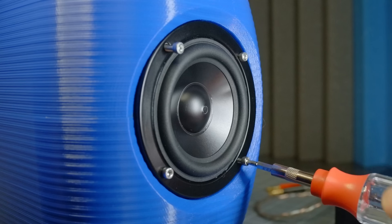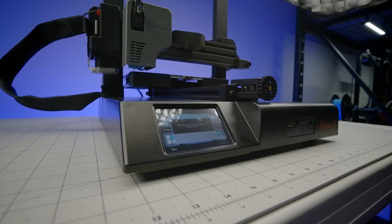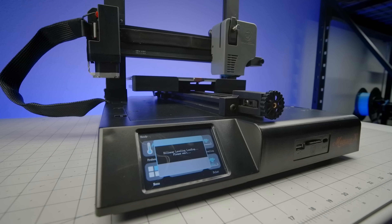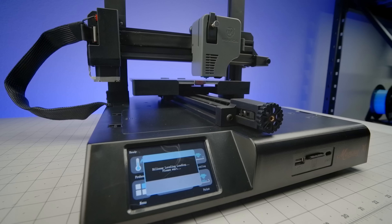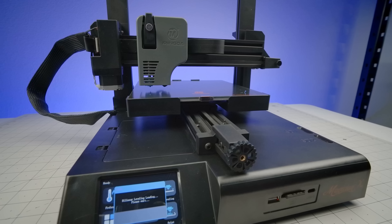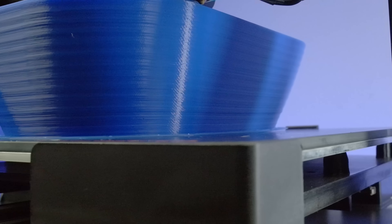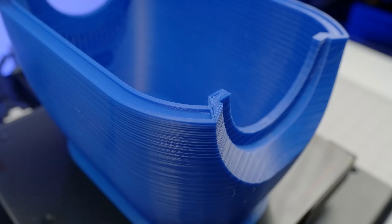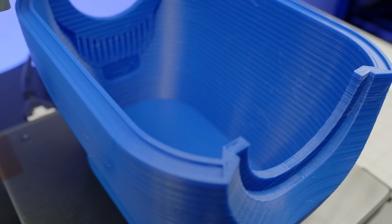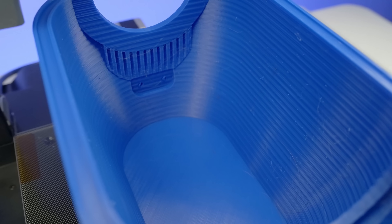It means that we're just about done. Though, before I cut to the sound demo, a few words about the machine. It's... not quite there, is it? The auto-leveling feature doesn't exactly eliminate the need for manual adjustment knobs — it simply replaces them with the need to manually baby-step the Z offset with each new print. The build plate doesn't stick, even with the temperature cracked up to 80 degrees, and then there's the glaring issue of print quality. Needless to say, I expect that some fundamental changes are underway for the production version of this machine, and I wouldn't necessarily write it off strictly based on what you've seen here.